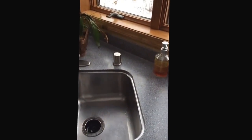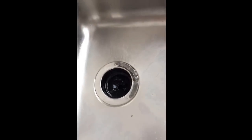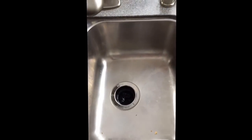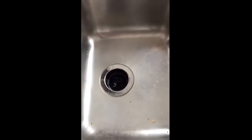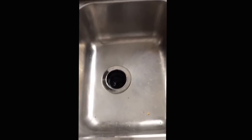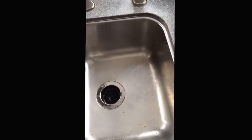Alright, well this is my video. I want to change the flange. It's probably hard to see but I didn't use plumber's putty — I used the rubber gasket like the directions recommended, and the thing is sticking up about a millimeter higher than I want it to be. So I'm going to try to take everything out and redo it so it sets down more flush.